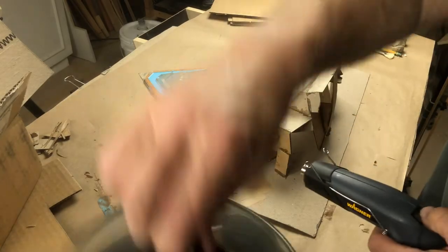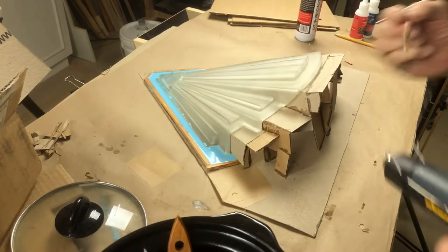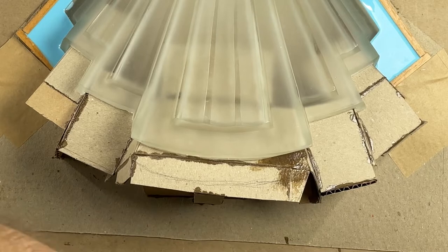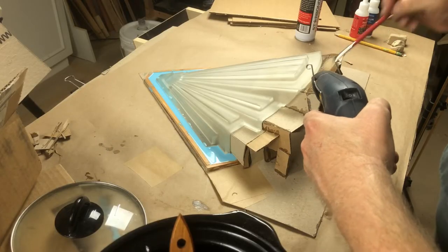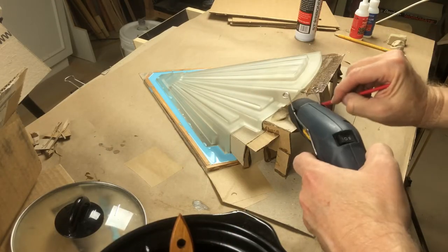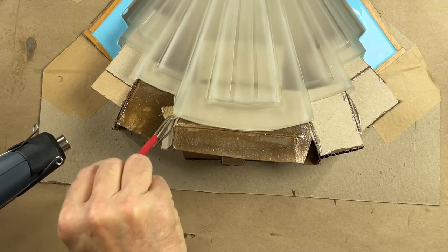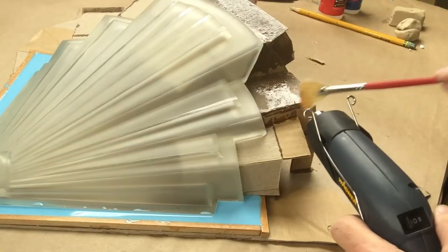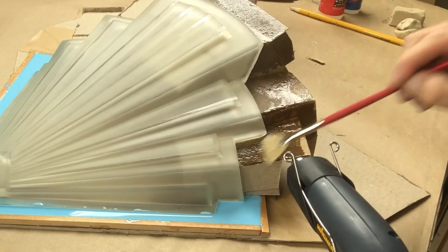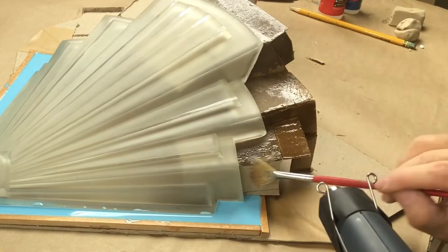Now let's break out beeswax. I'm going to use a finer brush because I don't want to get wax all over the glass — I'll just have to clean it off later. But I need to make sure that this cardboard is well waxed because it is going to get some oil clay on it, and there may be areas where the rubber will actually touch the cardboard. In those areas, I want to make absolutely certain I have no issues with adhesion — I don't want the silicone rubber sticking to my cardboard. This little fan blender brush is perfect for fairly precisely laying on beeswax.